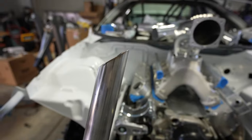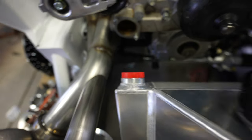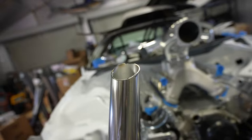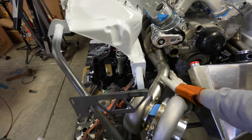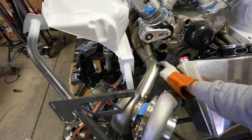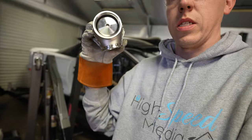Before, when I drew my line, I just kind of held it up to the pipe and looked at the angle I wanted it to come out at. It doesn't touch at the top and the bottom, but through the middles it touches. Obviously, my cut's a little goofy there. I need to grind kind of the centers of each, then it copes around the pipe right here. It doesn't need much, but it will need a little bit. And the tighter you make this, the better. Then I'll probably tack this on, draw a line around it, bring it off the car, remove the little gate, and then cut the hole out to feed the wastegate and all that stuff. You have to keep in mind that there is a flange that comes off of this that takes up some distance.